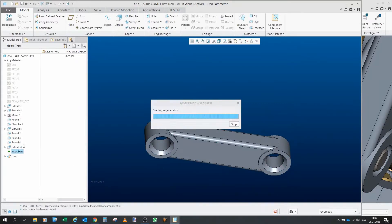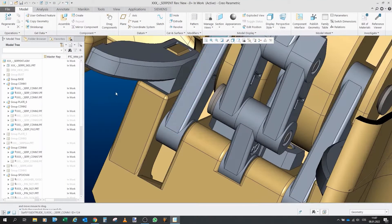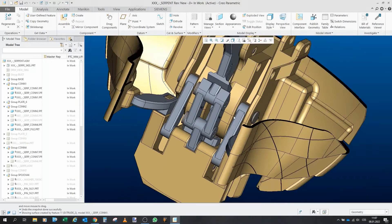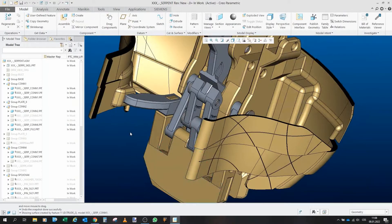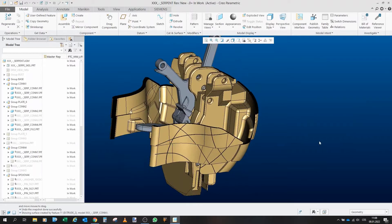That's only because of the printing. I also created a sort of washers which are 0.5 millimeters thick, and the idea is to place them there so that the original thickness of the link is still achieved. They are not part of the 3D data, but you will see when I try to assemble everything that it's better to actually put them there — just for your information. So I guess we can now go to the printing and assembling.